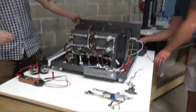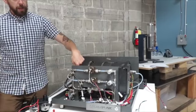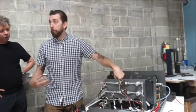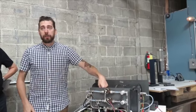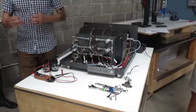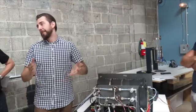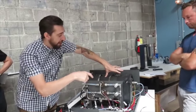So as soon as you have the machine plugged in, because this gets split, it doesn't allow power through to the contactor yet. But this middle component, the AC to DC power supply, has power as soon as the machine's plugged in, not even turned on. So that thing will turn on as soon as you plug it in. If you look close and you can bend down just enough, you can see there's a little green light that illuminates underneath it. Depending on the machine, you can't even see it. But it's there.